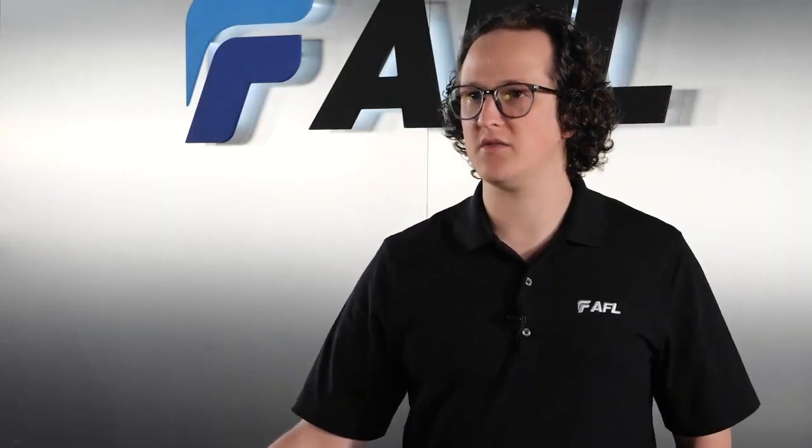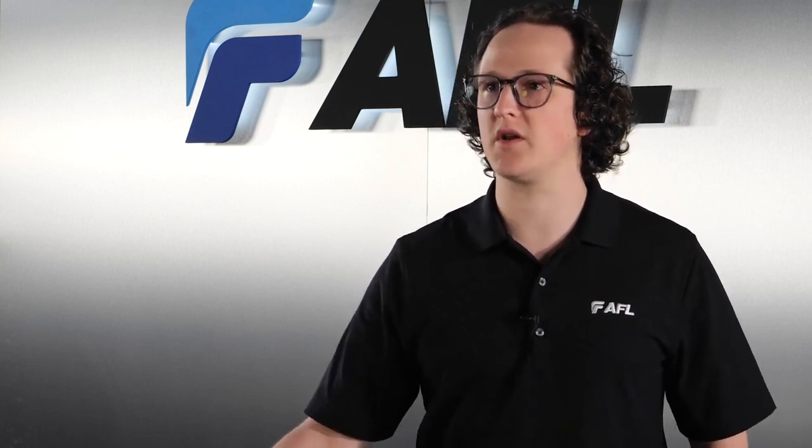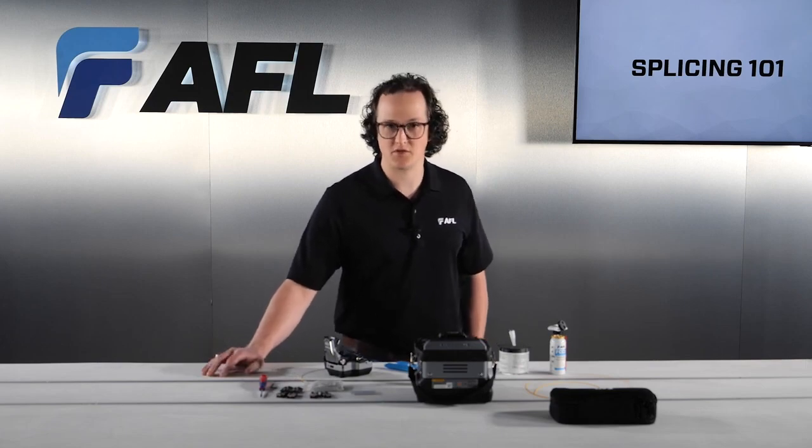Once the splice is finished, center the splice protector over the exposed glass and hold tension on the fiber while you lower it into the heater oven. Glass has a very high tensile strength, so don't be shy with holding tension on your splice.